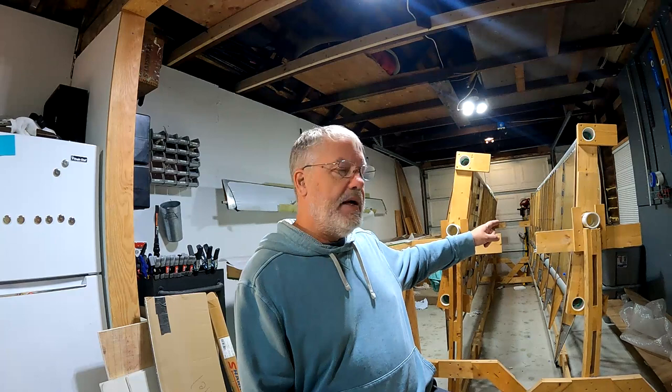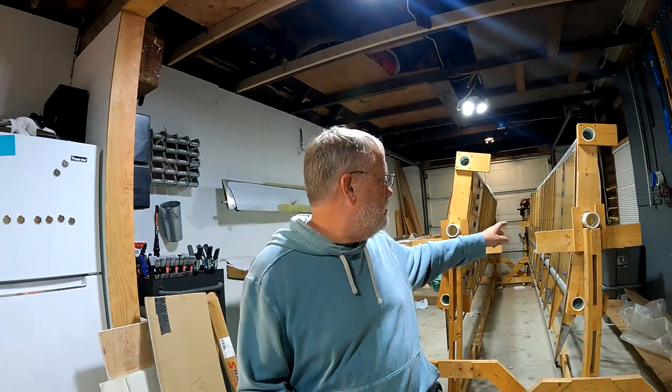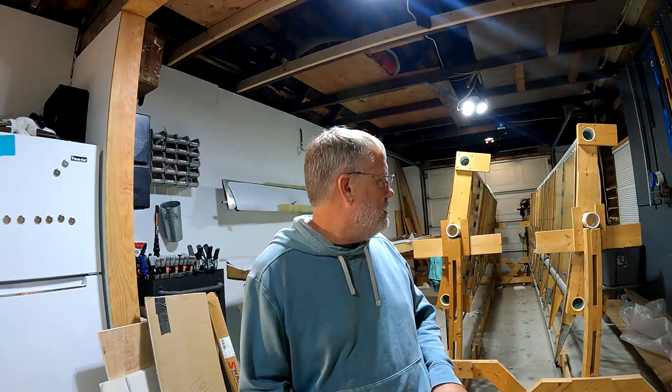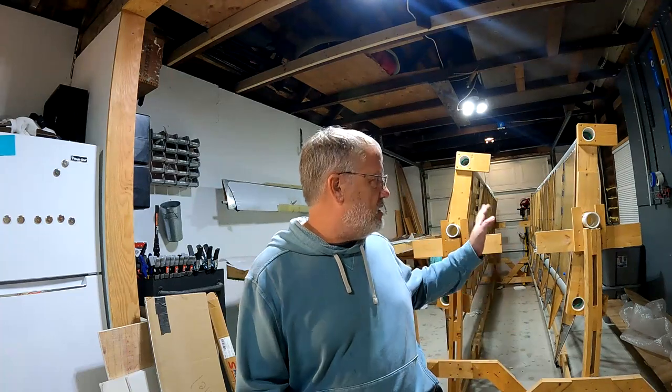One of the things I'm going to admit up front is that I got hung up on rib number two. Basically, it seemed like a difficult task to get those shims in there underneath that piece of floppy cap strip. I went down a rabbit trail where I created a check tool which probably took me 8 to 12 hours to make, and the process became very complicated in my head. I started looking on people's build videos and threads, and I couldn't see where anybody made more than a passing mention of doing their number two ribs. As it turns out, I was just thinking too hard.